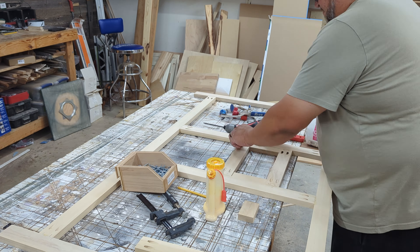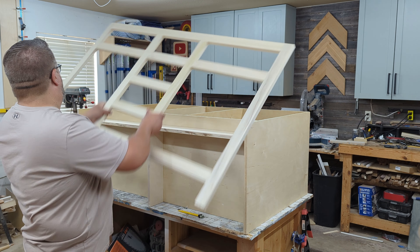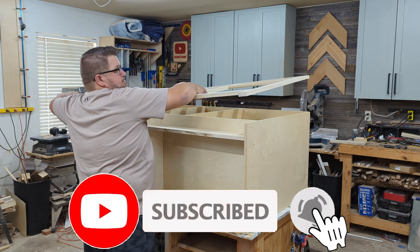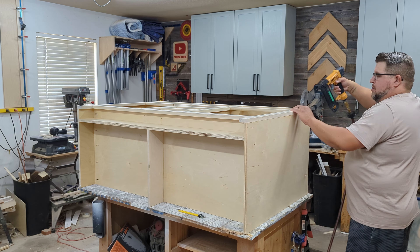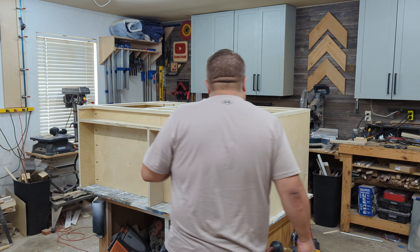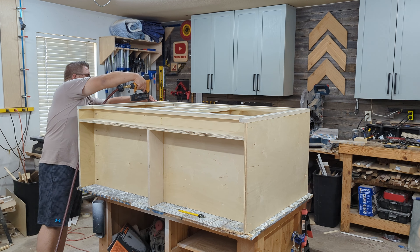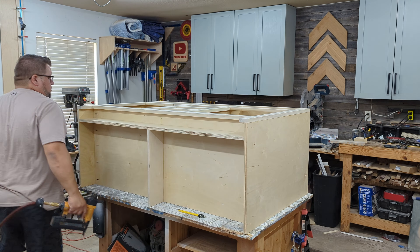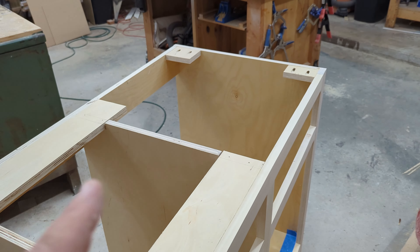We also add our drawer dividers. Instead of measuring everything out with a tape measure, I just use a spacer on each end to ensure each piece is perfectly spaced and square. After that I attach the face frame using glue and an 18-gauge brad nailer, taking plenty of time to get everything square — sometimes shifting the cabinet if I need to. You can measure corner to corner diagonally to ensure it's square. This is super important because once the face frame is nailed down you're committed, and the last thing you want is for something to end up cattywampus.